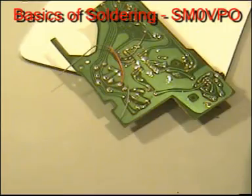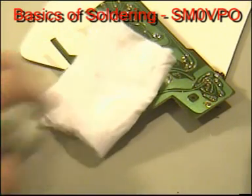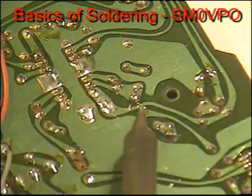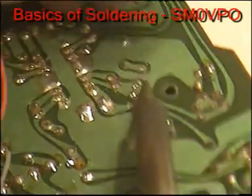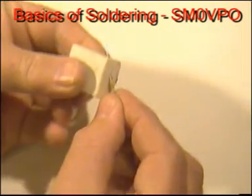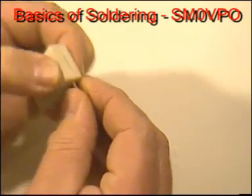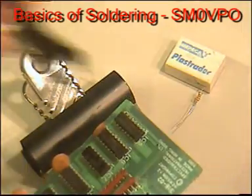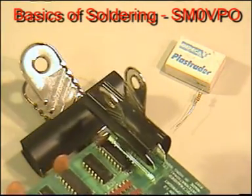You will also benefit from several small items such as a good clean bit of dry cloth. A dry cloth can be used to wipe excess molten solder away from a joint or a solder pad on a printed circuit board. A pencil rubber or eraser with a razor cut in it is an ideal tool for cleaning component leads before soldering. A large and small bulldog clip used as a heat shunt is another good tool.